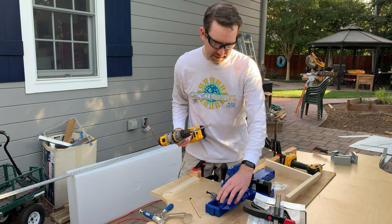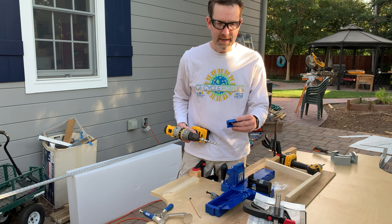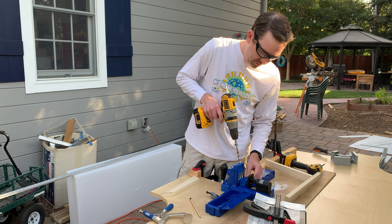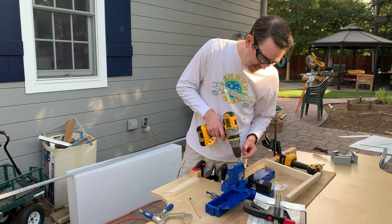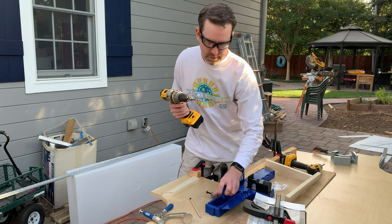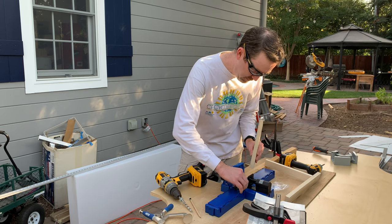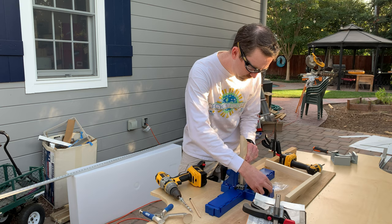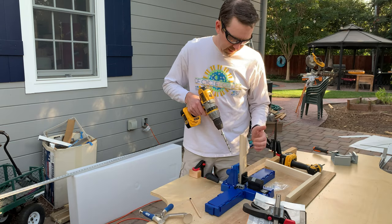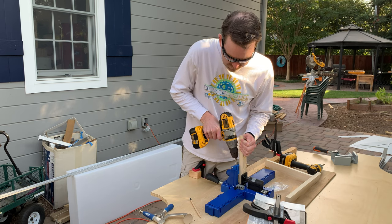You actually start out very easy. You look up on a chart to see what size screw you need, and then from that you see here what size screw you're going to use, and then put your drill into this hole like that, and then you tighten this clamp right here that allows you to have the perfect depth for your piece, and then simply put it in, clamp it down, and then you drill both holes until you hit your stop.